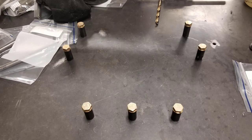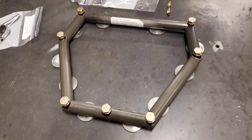So once we received the CNC cut tubes and checked that all the parts are in the bags, then we adjust any of the fillets. We go to put it all together and fit it. If there's anything out slightly, burrs, or it may have been cut on a certain angle, you need to clean it off a little bit with your die grinder just to make things fit perfectly. And then you get everything mounted onto your weld jig, and you want the closest, tightest fit possible.